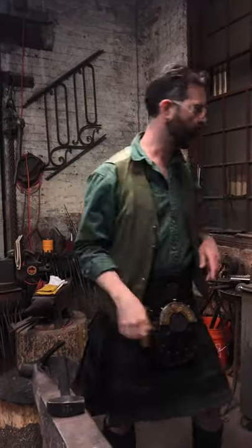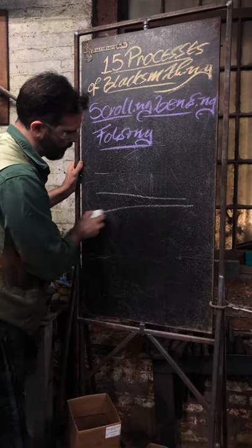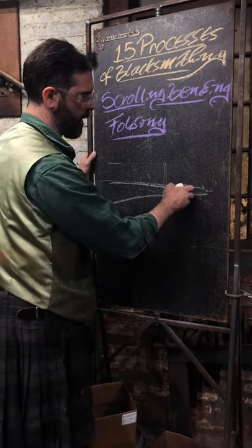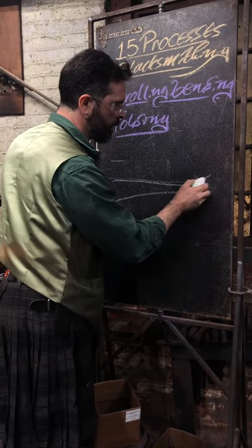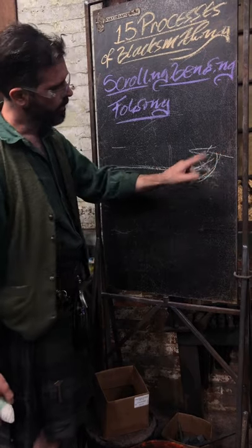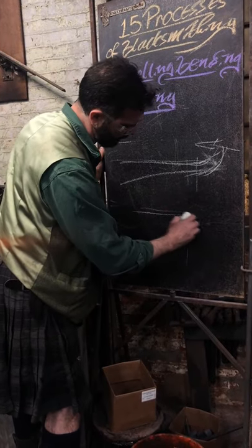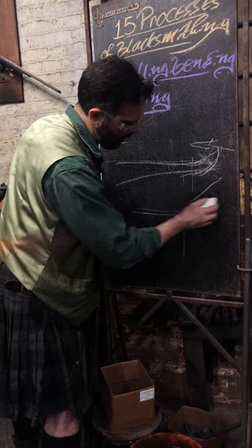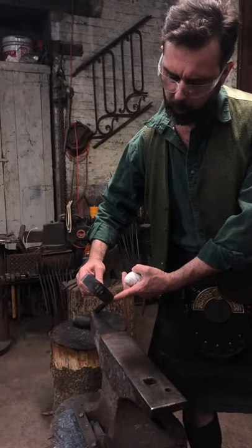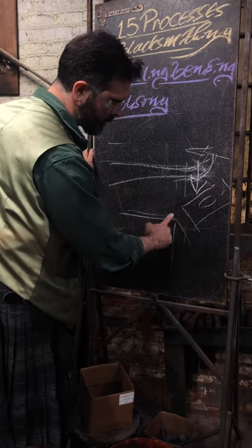If you're hammering end-on to your material and you're trying to get the tip to scroll up, and your material is flat with no turn in it, all the force is just going to upset it straight up. You need at least 90 degrees of turn so the force is actually creating a turning motion. Likewise off the other edge of the anvil, I take my hammer sideways — more of a glancing stroke with the hammer face at 45 degrees — so the force coming down glances and creates rotation.